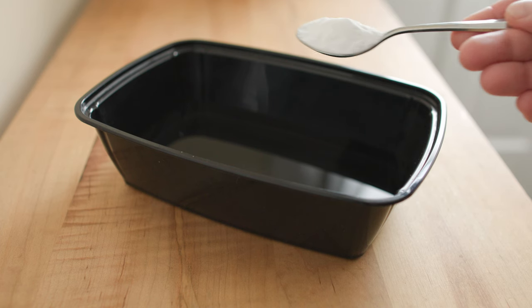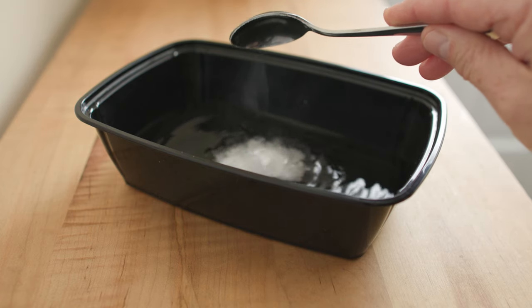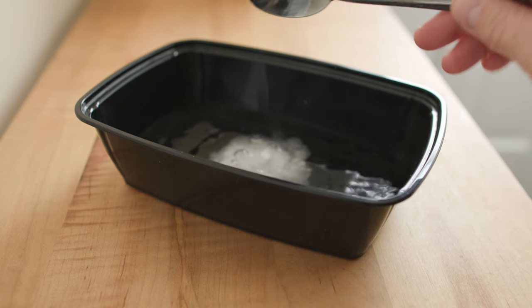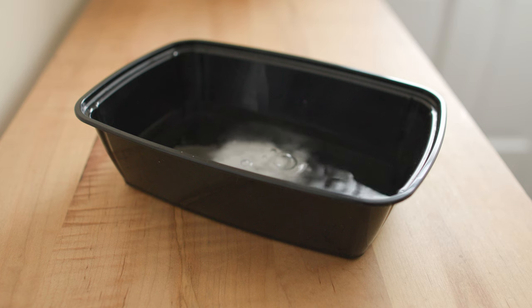So I create a mixture on that same 16-to-1 ratio with baking soda and water. I know you're thinking water creates rust, but it's essentially the only way to apply this base to neutralize the acidic brine the hooks have been sitting in. It's only going to be in there for about 10 minutes, so it won't cause significant rust. And in the end, these hooks need to function in a wet environment anyway — so if they can't take 10 minutes in water, I'm cooked regardless.